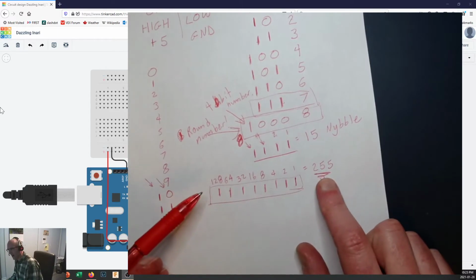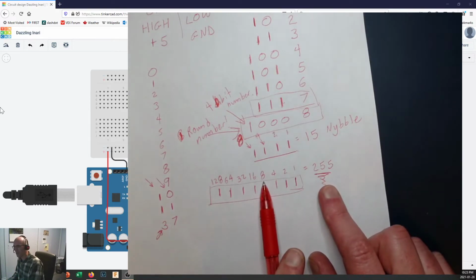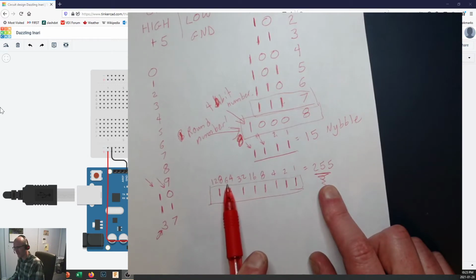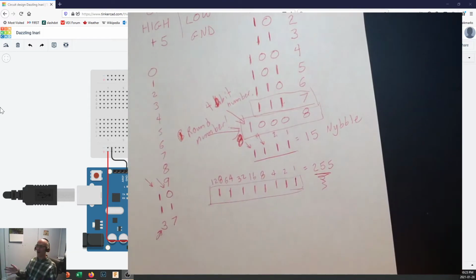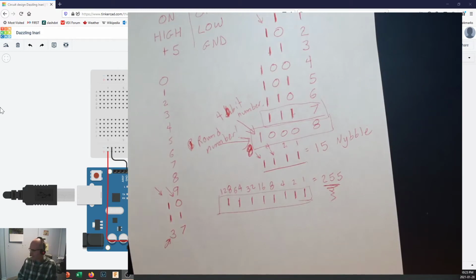We've got this 255, which, after watching all that, you're going to remember is a very important number. The other thing that you've probably picked up from this is that you have just deciphered Nintendo's numbering scheme for all of their game consoles. The Nintendo 16, 32, 64, and the 128, all based on their processors. I mean, it makes sense, right? Why wouldn't you do it that way? So there we go. We've got this AnalogWrite command, and the AnalogWrite uses an 8-bit number because the Arduino can process that 8-bit in one easy chunk.